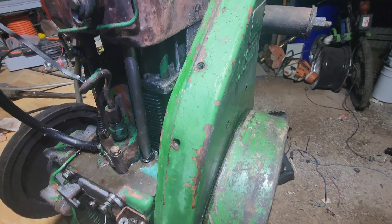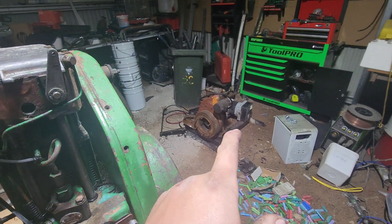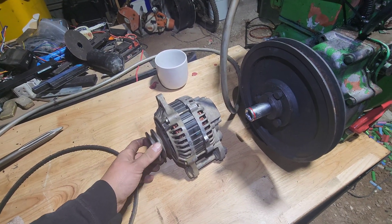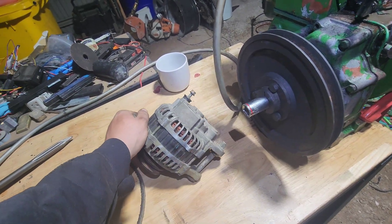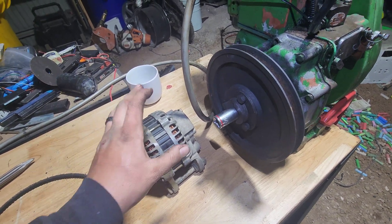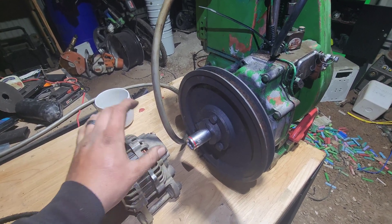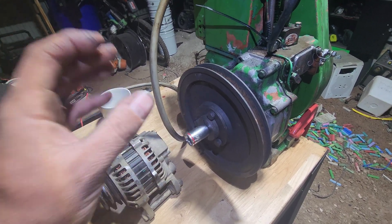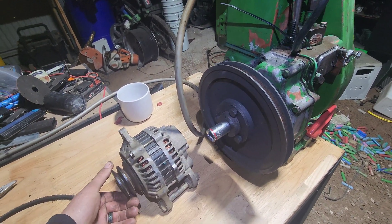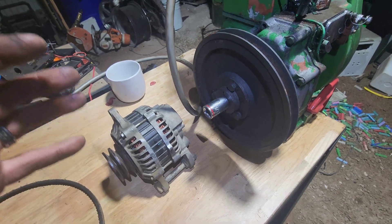There's the oil feed from the bottom up to lubricate the rocker assembly — I'll take the cover off for a look another day to see how clean it is inside. We'll do an oil change and recycle that oil back into fuel. We're going to put this one on wheels so it's easy to move around — same with that one, that's what the frame's for. This one will be 24-volt; we'll use a truck alternator — a 150 or 120 amp Mitsubishi Triton alternator. Another option is to remove the voltage regulator from an alternator, leave the rectifier, and push it into a solar charge controller.